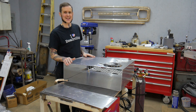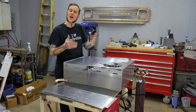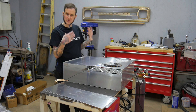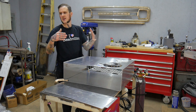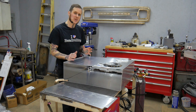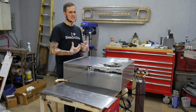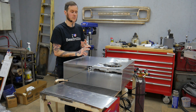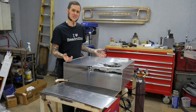The next consideration is design. For me, I'm able to fit this into just a rectangular box, which is great — a pretty simple way to go about things. Generally, the way I design a tank is to do it as simply as I can, with as few welds as possible, because fewer welds means less chance of leaking and less time involved in the whole process.